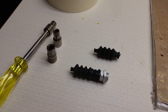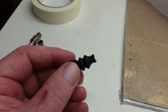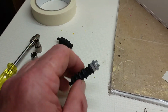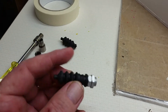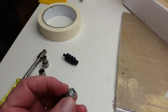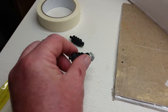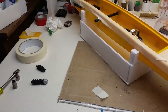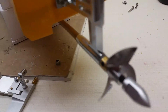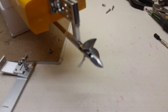We're also going to change the bellows. This one here came off the boat — it was just pushed in with a little silicone. I'm going to go in with this threaded one, which looks pretty nice and sturdy. Put it in, hit it with some silicone, tighten it up to the side and we'll be good to go. That's it for a quick update — next time I'll show you everything finished and ready to go.